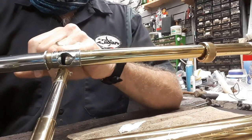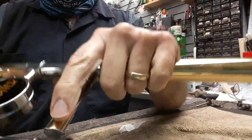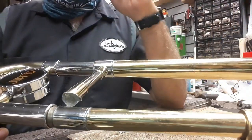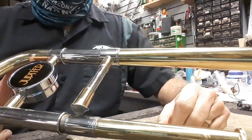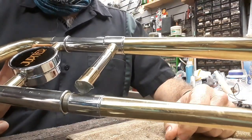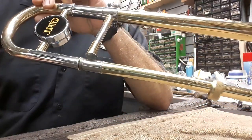What I'm going to do is I've got a nickel tube that is this size, and I'm going to make a new ferrule, and then I will take this portion, smooth that out, and then braze it onto the new ferrule, and then install the entire ferrule-brace combination. Is this part available as a separate piece? I doubt it, but even if it were, there's the idea of being a parts replacer, or being a repairman, or a craftsman, and I like to work with my hands and make things if at all possible. We'll get going on this, and it should be a real interesting, fun project.